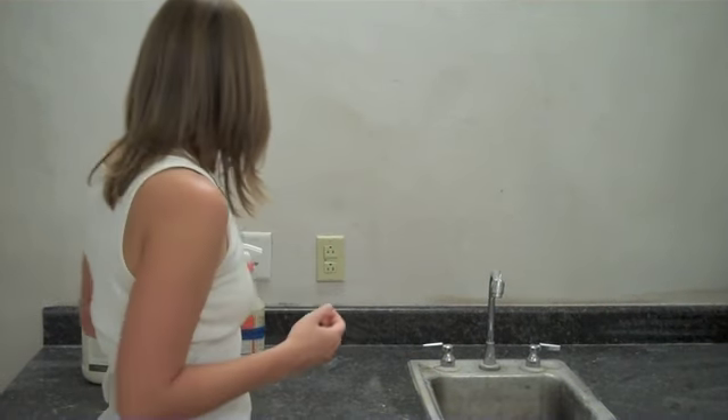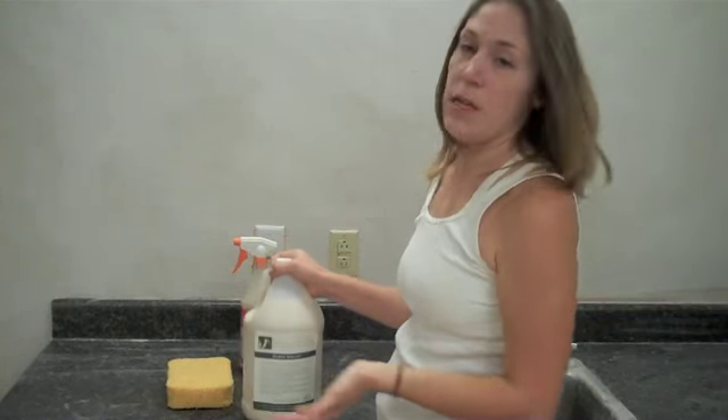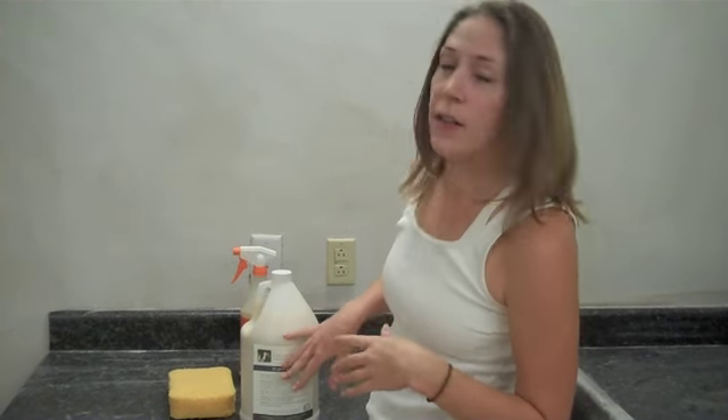I am not a fan of sealing, largely because our clay has a lot of benefits when it's left unsealed. It makes it much easier to repair, and clay naturally mitigates moisture and humidity in a space, so that moisture is not trapped in your drywall — you'll be less likely to have mold and mildew growth in an area that has humidity. So I wanted to leave it unsealed as much as I could, and just seal the area where I saw erosion.